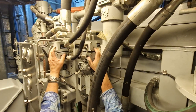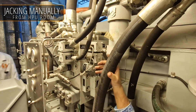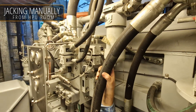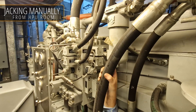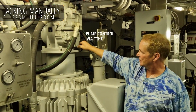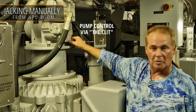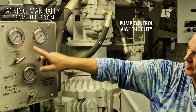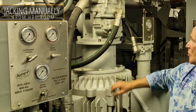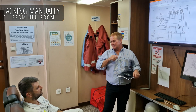These coils also have manual operators on them. You can jack the boat from the engine at the HPU by pressing the manual operators on the brakes. There's a little device that strokes the pump either to A or B, and you have a set of gauges right there. You move it to see if the A gauge comes up or the B gauge — if you want to go up, you go to A; if you want to go down, you go to B.